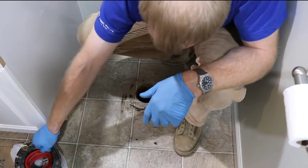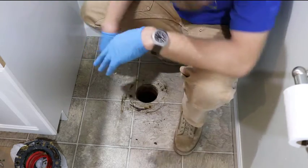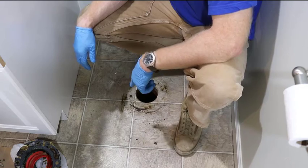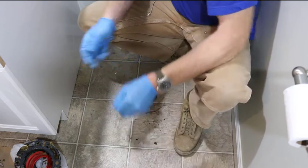So this is probably, there may or may not be a cast iron flange down there, but this is cast iron pipe. So it looks like I'm going to have to actually do some roto hammering and chisel this area out. We might find the pipe down there, we might not. Or sorry, we might find a flange down there, we might not.